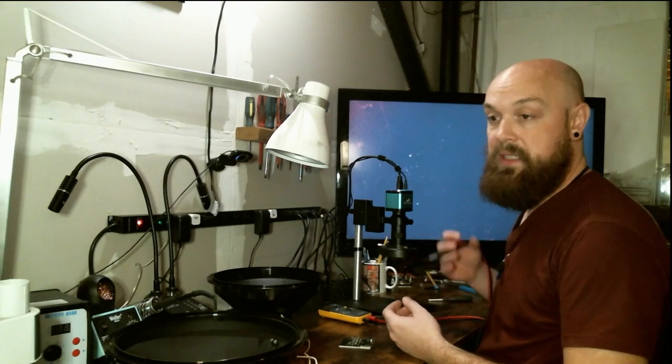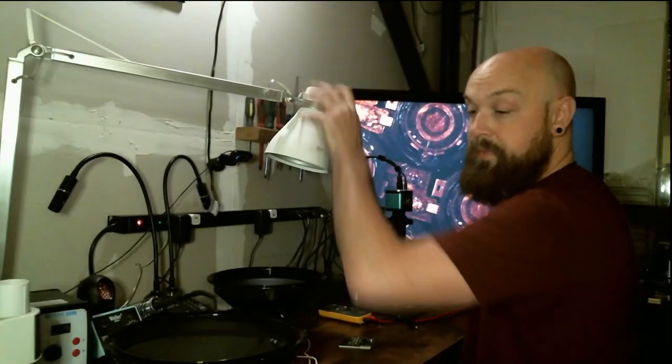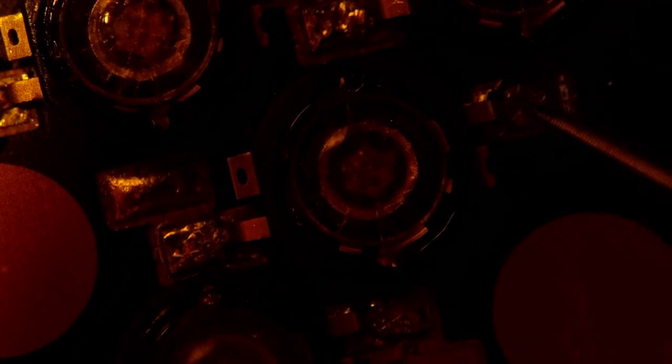Let's quickly go back to our other ones to see if those work as well. We'll start with the first one we tested. I'll leave the light off and switch over here. Nothing. Nothing. I don't think this one's good — you can visibly see the cracks in the LED. I think this one's done. Nothing — not even one of them. I'm not going to reverse my leads on this; we're going to just count this one as done.